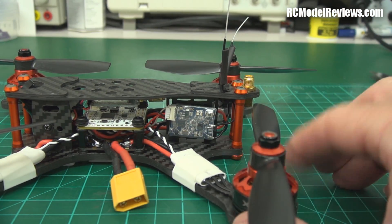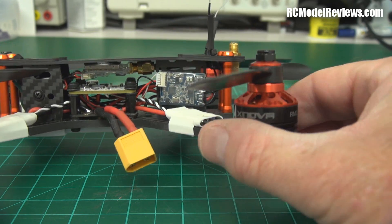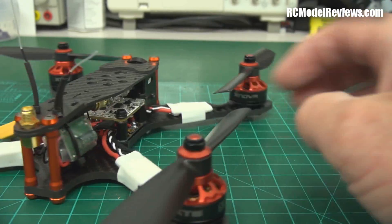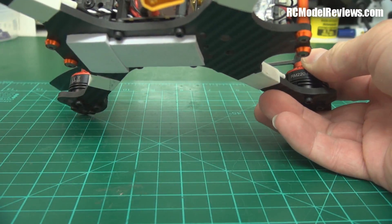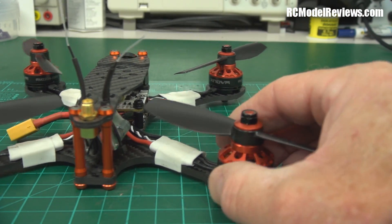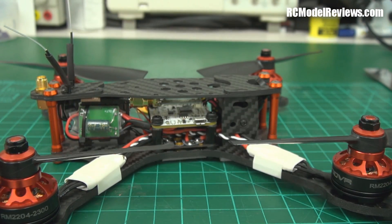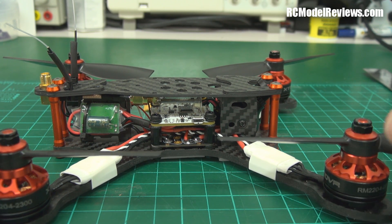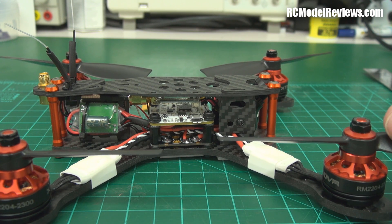Down the other end we've got the new receiver from FrSky — it's got S.Bus output and possibly CPPM, two antennas for diversity, and it's really small and light. Perfect for mini quads — one of the first ones out there. On the other side, hidden up in the top, is the FPV video transmitter with an extension lead out to the SMA connector on the back. We've also got a switching voltage regulator — a BEC from D-Sun — with an extra cap added to reduce noise, which is a good move. The flight controller is a Naze32 revision 6B, which is the non-buggy version.